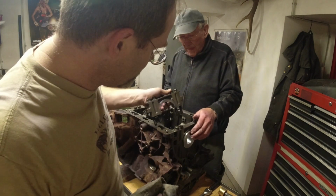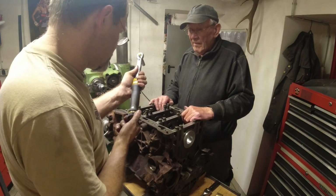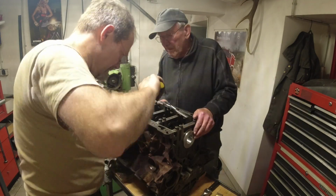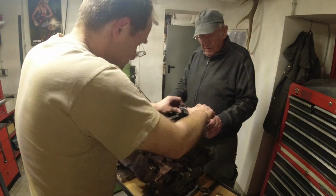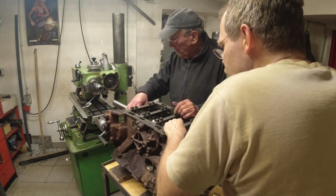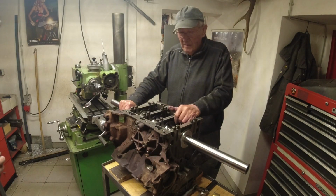And because they have a little bit of play in this direction, we're gonna have to maintain a tightening order. So we're gonna give it 12 Newton meters to pull the block over in this direction. And we do the same on this block. So the bushings are still somewhat loose. The bar is in, and if we tighten it up now, these bushings should tighten up. 60 Newton meters.